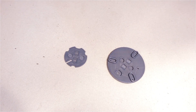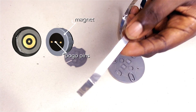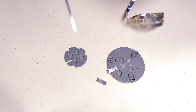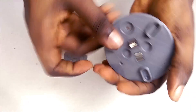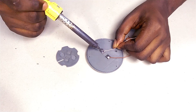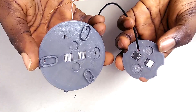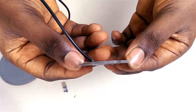After that I went on to setting up the magnetic charging base. The general idea is to make the base of the speaker into a magnetic connector, but instead of pogo pins, I'm using nickel strips as the contact pins. All the slots are pre-made, so all I need to do is cut short lengths of nickel strip and insert them into the slots. I also soldered two wires to the back of the strips, which will later connect to the input pins on the charge protection module. I repeated the process for the second magnetic connector, but this time I allowed the nickel strip to protrude a little above the surface.